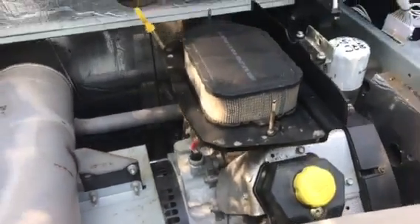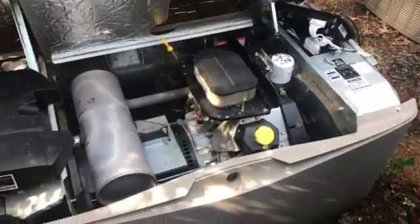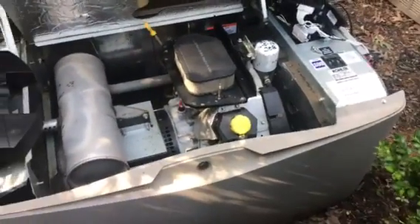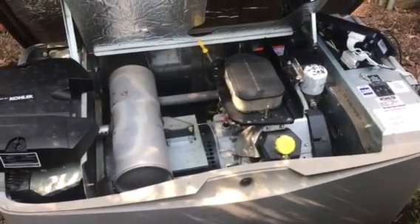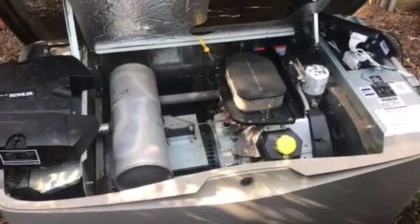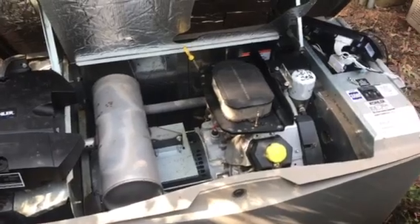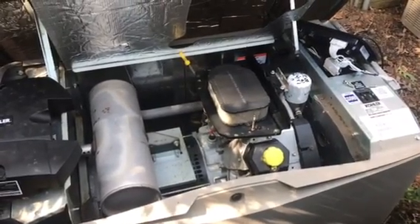However, these governors are fairly inexpensive and they just bought a brand new controller, so I'm going to put a new governor in for them. I'm not going to try to fix a $50 part – I'll just put a new one on for them. Hopefully that helps you out with some hunting issues. Make sure you check your fuel pressure and everything first, but this is definitely something to look for.